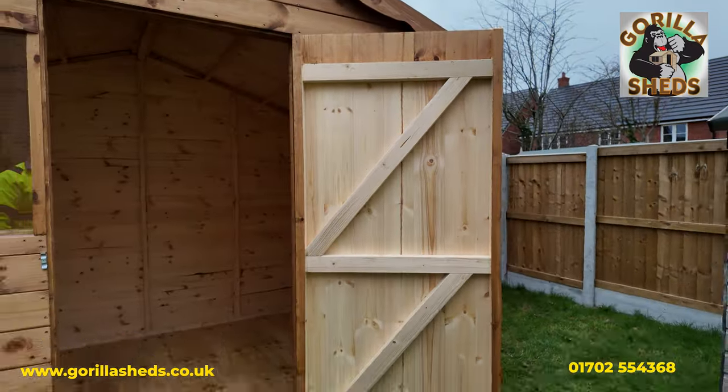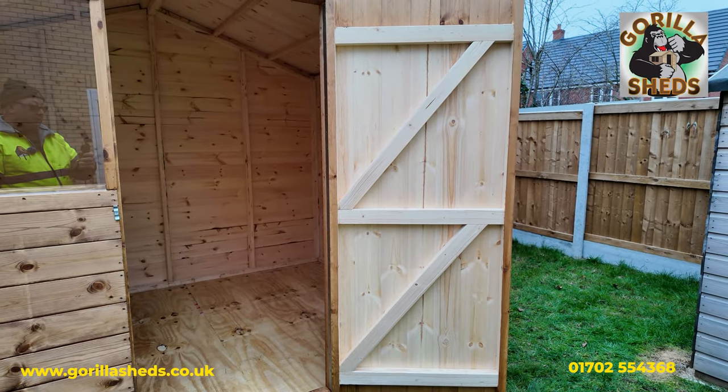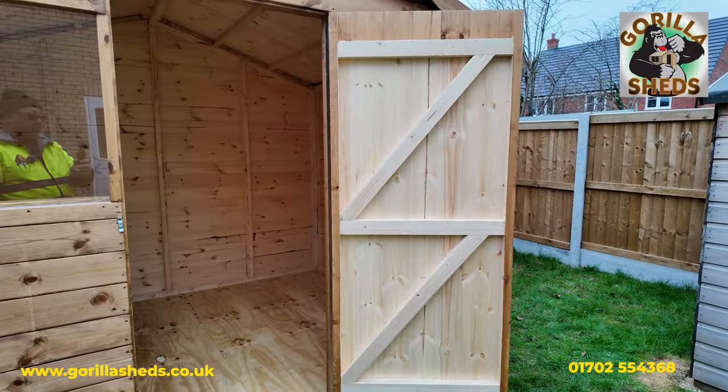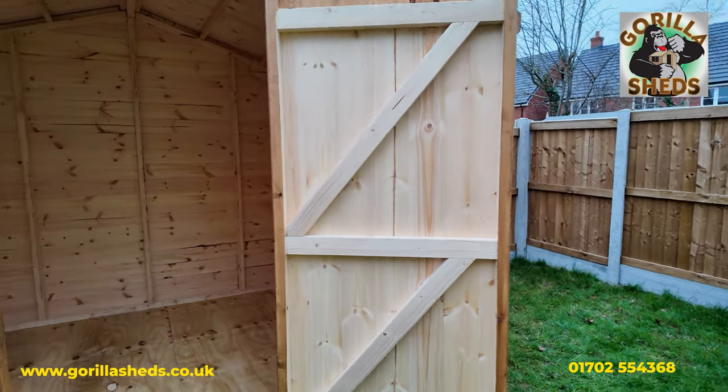So the door on this shed, same as all our sheds, well, except for the summer houses, is a ledged and braced door. So you've got the ledges going across the side, all planks together, and you've got these diagonals here. They're your braces, and that stops the door from dropping.